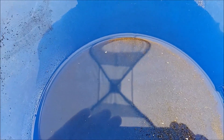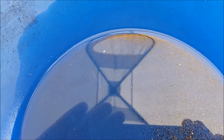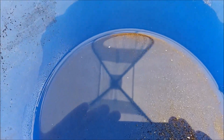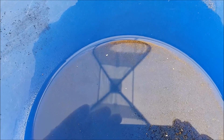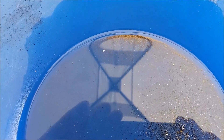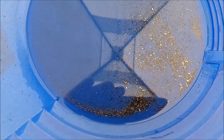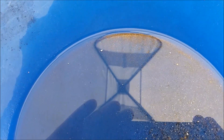So I'm going to have to do this again — incinerate some more chips and see if I can get the gold out. One takeaway from this is that I need to sieve it much finer, because these gold wires are really, really fine. Probably I need to sieve it to minus 30 or even minus 40, and I'm sure I'll get all the gold wires through and leave behind a lot of the crushed IC junk — which makes panning out this super fine gold difficult.